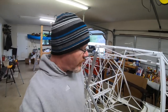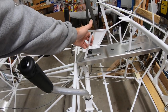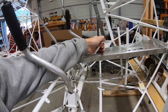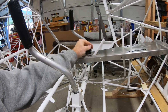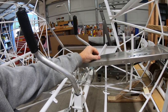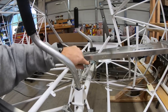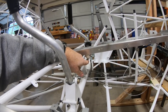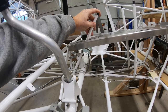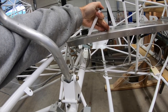The other thing I'm going to dive into today is the center console and the flap bracket. The flap bracket has only two positions and I don't like that, mostly because there are times in flight where you may want to just bump up a little bit of flap to help raise the tail — that happens at high density altitude when you feel like you're behind the step while flying. You can see where the groove is for the first notch. I'll probably make two additional grooves in there so I have an intermediate two steps between the two positions, giving three positions total.